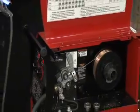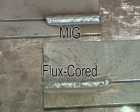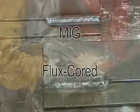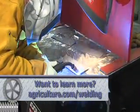When you get into MIG welding, we're using a gas shielding and a solid wire, and there is no slag, which creates a clean weld. A nice clean weld is ready to paint when you're done with it. It works a little better on thin materials, and gas shielded MIG welding operates on DC positive polarity.